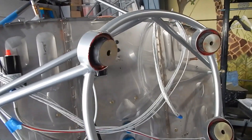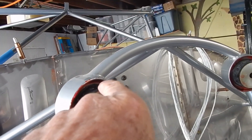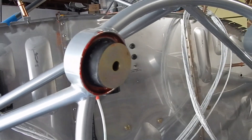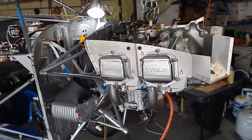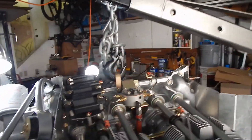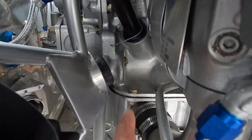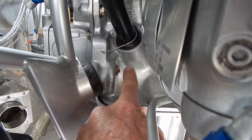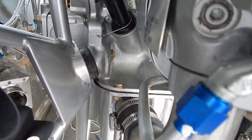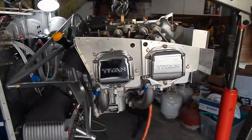The manual says it makes it easier if you lubricate the mount cage and the backside of the bearing. We also made sure to orient the little tab straight up and down — a couple of builder videos said that's important, even though I don't see it in the text. It took a little finagling to get the engine on and get all the bolts through. You've got to keep raising and lowering by a fraction of an inch and pulling it in, getting one set, then working on the other. For the bottom bolt, when it gets torqued all the way through, you can't get the wrench off, so we had to grind down a wrench to hold that nut. But it went in — probably 30 minutes, not a long time.